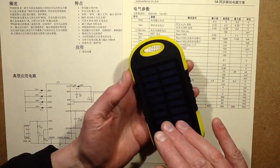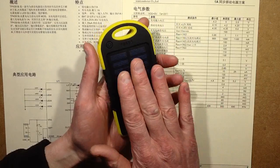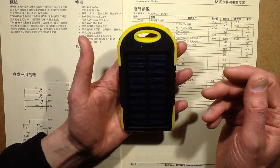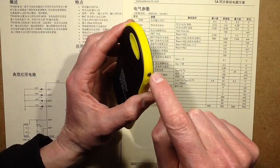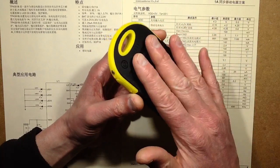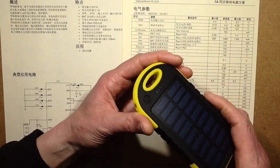The quiescent current is not really that critical given the solar panel, although obviously this isn't designed with that in mind. In the case of this unit, even just ambient lighting is going to give a few milliamps during the day, which is going to more than compensate for quiescent leakage - the quiescent current being what the chip draws from the cell when it's in standby mode. When I put the white LED in, as a precaution I disconnected the lithium cell, and just out of interest before reconnecting it I held it up to the light and pressed the button to see if it would kick-start the circuitry. It did - it lit the warm white LED through the chip, and it stayed lit for quite a distance away from the LED floodlights. That was quite interesting.